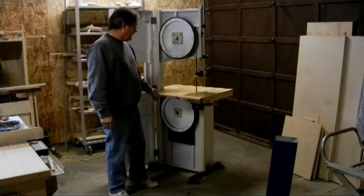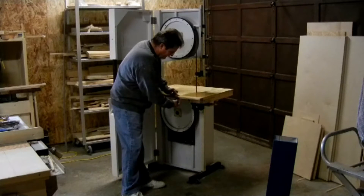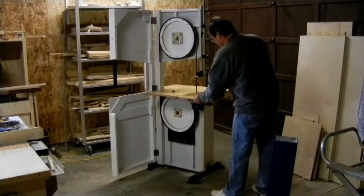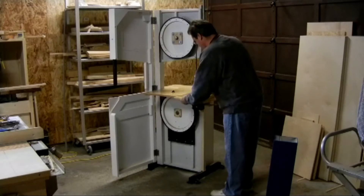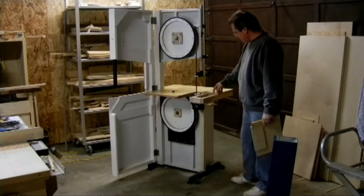The lower blade guide is down here. To get at the blade guide underneath, I made the table a little bit differently than a standard bandsaw. You can take this part off — this whole corner section comes off. It's got a thumb screw here. Pull the thumb screw, get this board out, then loosen this one back here, slide this part right out. It slides into a slot right here. Line it up properly. So that allows me to access the blade guide under here.